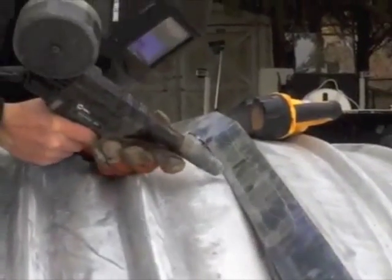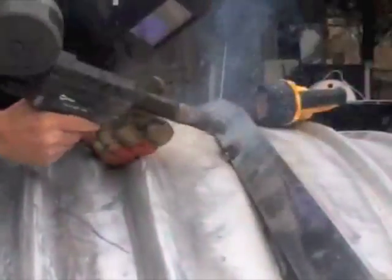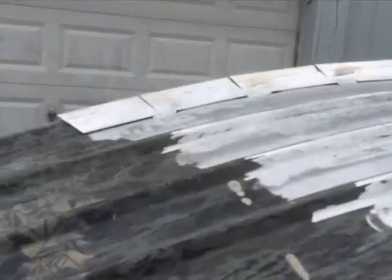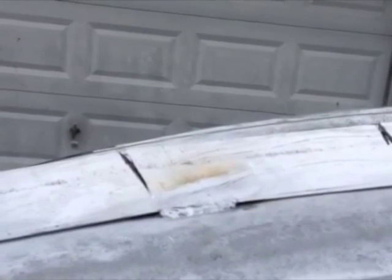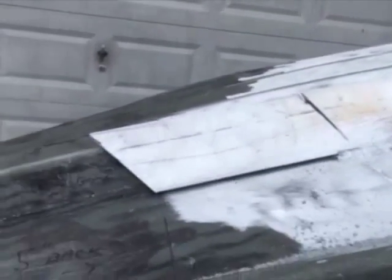There's about as tight as it gets. Now you might be wondering why I didn't notch the other way on the back side so that the gap would close up — but it's easier for me to just lay it down this way and fill the gap. I've worked with welders that were horrible fitters and gave gaps worse than this on thin-wall stuff, so this ain't a problem. Anyhow, I've got it closed up and everything tacked down — now I just weld it out and be done.